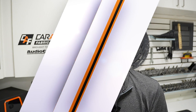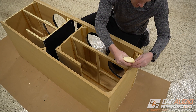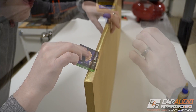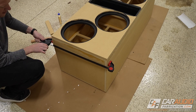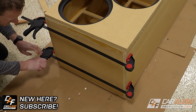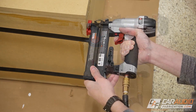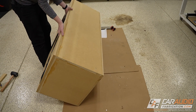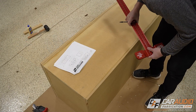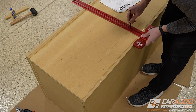Let's get on into finishing this enclosure. In order to pick up where we left off, we first need to apply this front piece of the subwoofer enclosure, and that means we need to apply a ton of wood glue to all of the mating surfaces, ensuring that we get full coverage on each surface. The process here is we want to use clamps in order to secure the board in place temporarily, and we permanently mount it in place using brad nails, which allows that wood glue to completely dry, giving us a nice strong connection. I also want to secure this side piece to the inside geometry like the port walls and the brace, so I'm mapping out the locations of those based on the dimensions within my blueprint drawing.